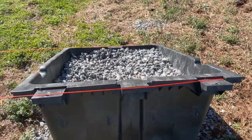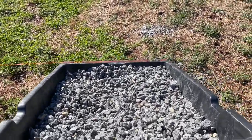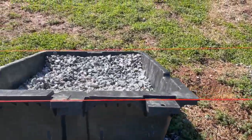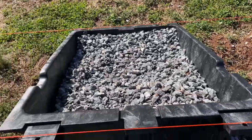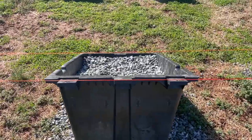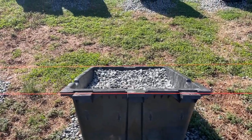You also have to look at the height. The bucket needs to be straight because the panel frame is straight. So I tried to level these out as best I could. The panel will flex a little bit — I'm not concerned with an eighth of an inch, but when it's an inch off I had to level it.